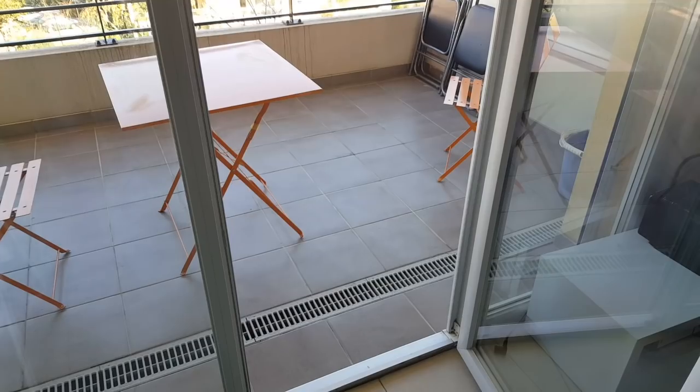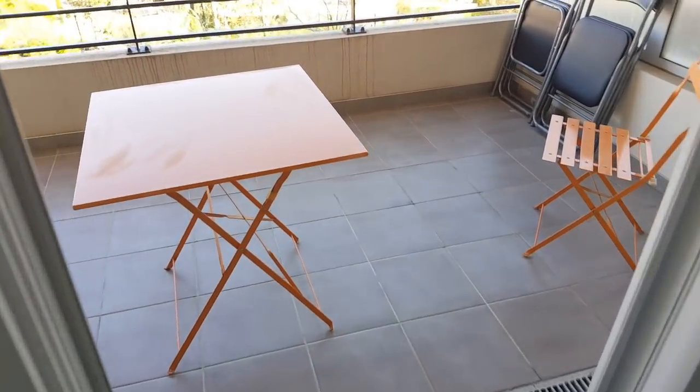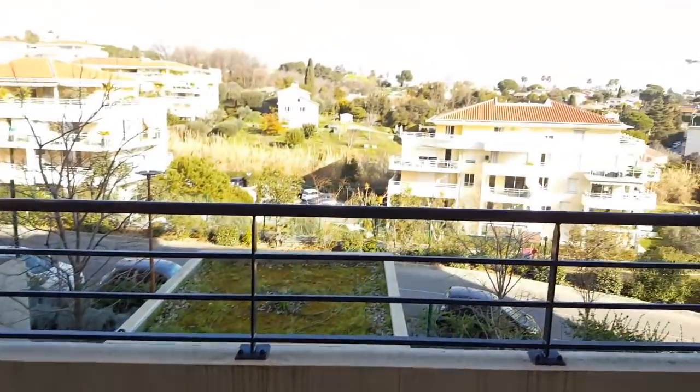Now about the reason why I want to build a magnetic loop antenna. As it turns out, I live now in a very, very small apartment and I need an antenna for HF. So the only thing I can really make that's not going to be too big for my terrace is a magnetic loop antenna. I did build one a while ago in Florida, and it was a 21 foot perimeter magnetic loop, and it worked extremely well. I was hoping that my old loop would cover 20, 30 and 40 meters. But it covered only 30 and 40 meters because it was slightly too long for 20 meters.